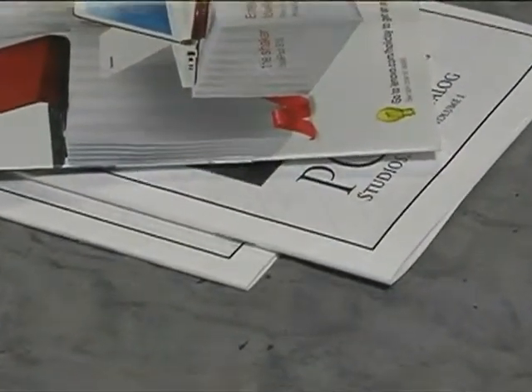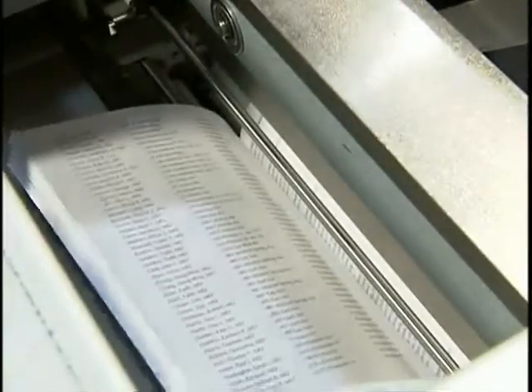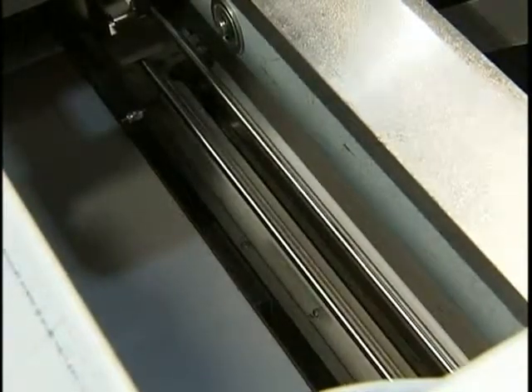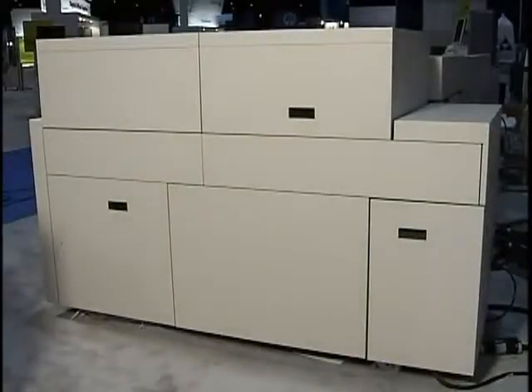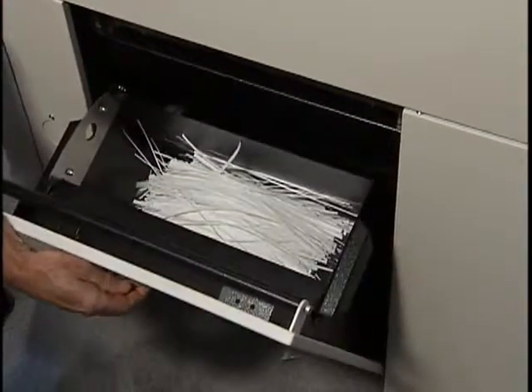The square fold feature can be bypassed for thinner books up to 1.5 mm if required. The book is then dropped vertically to the cutter, where the face is trimmed by a horizontal blade. The finished book is then grabbed by the output transport and delivered to the integrated stacker. Trim waste from the cutter is accumulated in a bin located on the end of the PowerSquare 200, and this bin can be unloaded while the system is running.